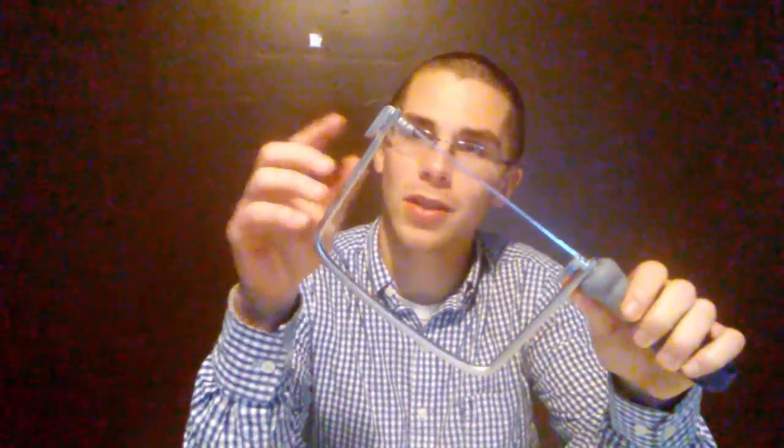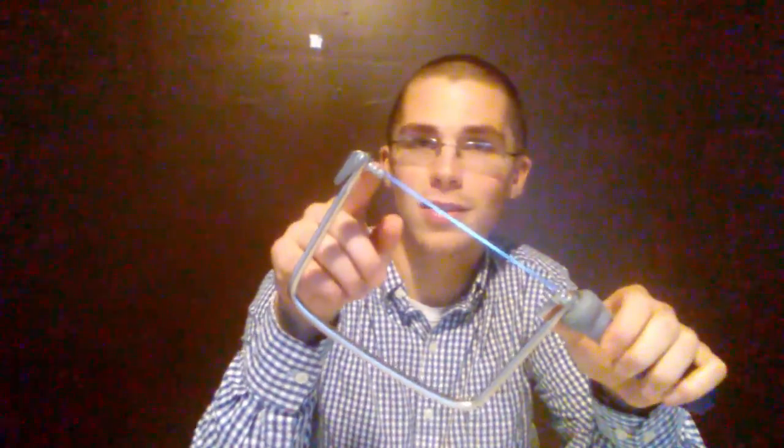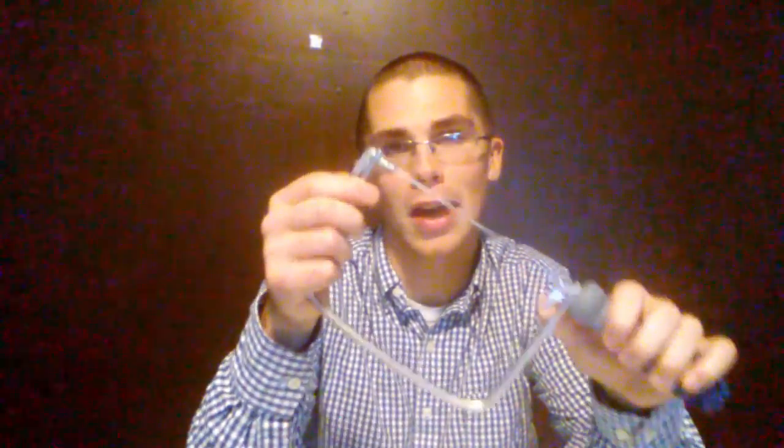The next part of the video is: how do you work with a coping saw? There are a few things you need to know if you own one. Two of those things are: you need to be able to change the blade and you need to know how to rotate the blade. This leads into some of the main functionality of the coping saw — there are these two tabs, one at the top and one at the bottom of the blade. These are fixed to the blade and if you rotate them, it allows rotation of the blade.